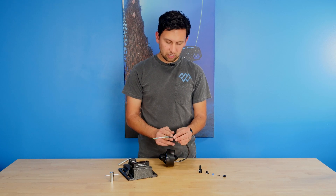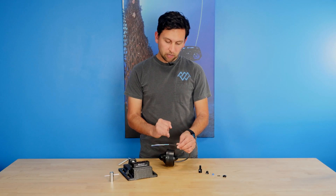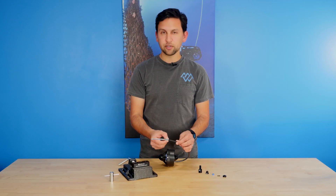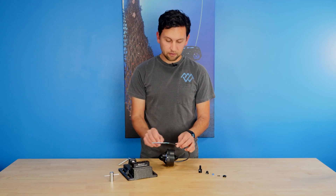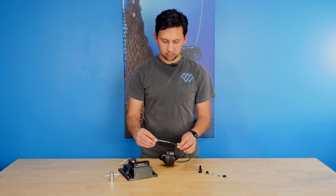I'm going to start off by looking at the end of the cable. I've already stripped the jacket and cut this one to the length that I want, but I want to inspect and make sure that the end of that jacket is cut nice and squarely and that there's no fibers or filler material from the cable sticking out. We don't want that to get caught in the seal or it could cause the seal to fail.